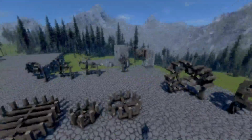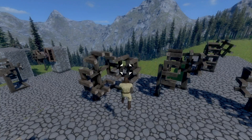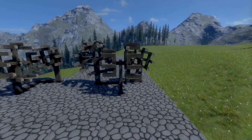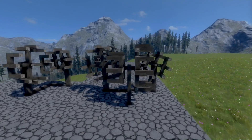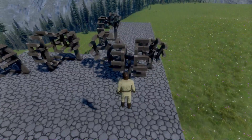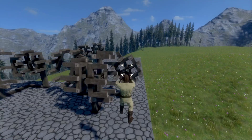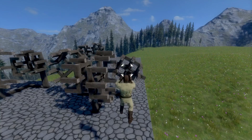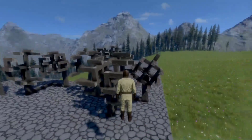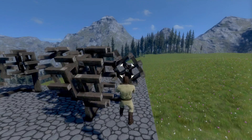To summarize: the gears actually work and we are getting an increase in torque, the way they would work in real life. But there is a downside. When you start upscaling — like this build which combines two gear reduction stages for even higher reduction and more torque — we're actually getting less torque out than we're putting in. That is the opposite of what we want.